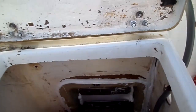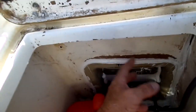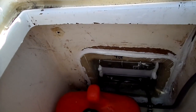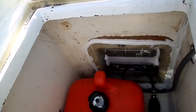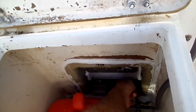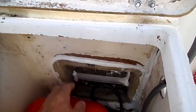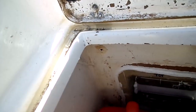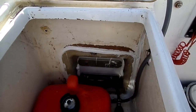In here is where a lot of the work went in, and this is where my mold went. I've basically used fiberglass, Q-cell, and strand to glue that all in — not just Sikaflex. The Sikaflex went around afterwards to give it a good seal so no fuel fumes get into the cabin. I've got a poly chopping board in here and the stainless flat bars — you can see the bolts that are tapped into the outside bar and the bottom bolts coming through down there. It all looks pretty strong. Hopefully there's enough strength to keep it all in one place. Now let's go get the thing started up.